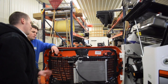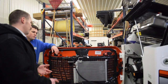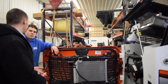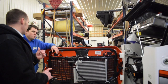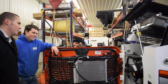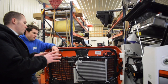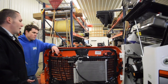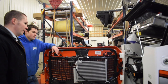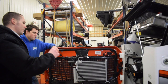By repositioning the engine, they were able to go back to a round air filter, so it's a lot bigger filter and a lot more cost effective — quite a bit less money to replace than what the square filter was. The square filter was also a pain to get to. Overall, repositioning the engine actually gained a lot of service access. The fuel tank is obviously bigger and easier to get to.